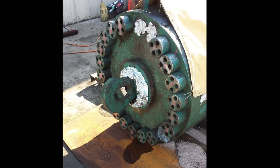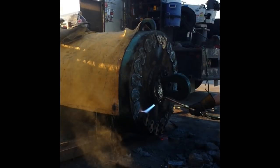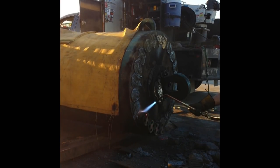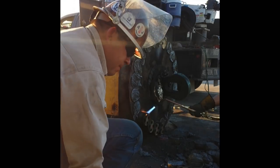I said yeah, no problem. I show up and I find this, which is quite funny, but he had struggled quite a bit to get the two off. So I suggested cutting the heads off of them. My reasoning for cutting the heads off was to relieve the tension that the bolt had onto the holding of the flange head. What helped to do that was to preheat the bolts and then be able to torch through them all in one pass.